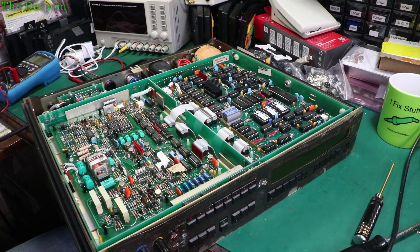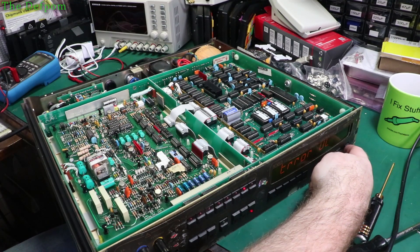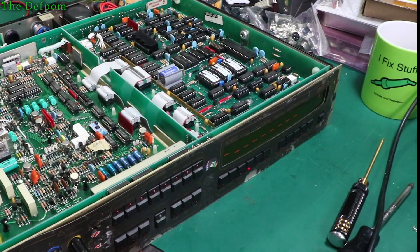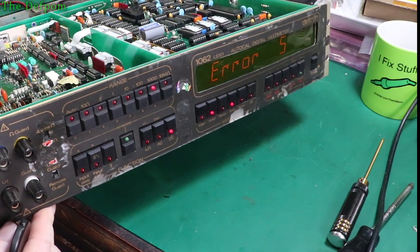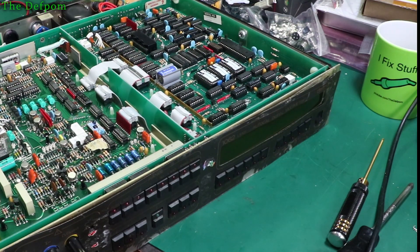I've replaced the fuse. We have 33 watts again — 160 milliamps. I don't know why that current draw is a little bit high. Let's see if we get anything different. 33 watts after re-seating those chips. Nothing so far. Let's do a test. Error 5 same as before, and pass, and error OL — no different, nothing's changed. So there probably wasn't anything wrong with those chips as far as the seatings go, but at least now I know they've been done.